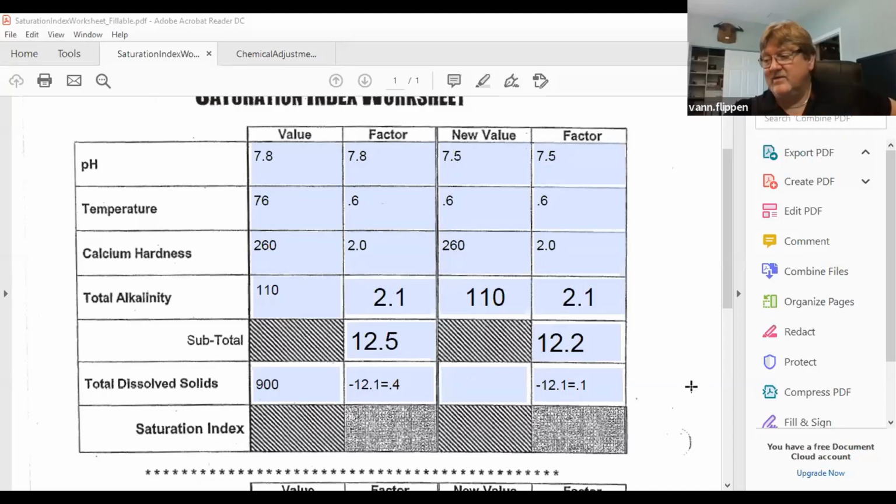I can't emphasize enough getting your customers, or if you're actually a maintenance person, to focus on water balance rather than just trying to go after pH and chlorine every day. If you focus on that water balance and you start to understand that everybody's pool is going to have a tendency to do something. Some people may have a pool where the pH constantly rises all the time. Then overcorrect it down to the low end and let that demon take it up.